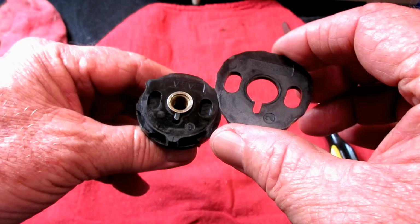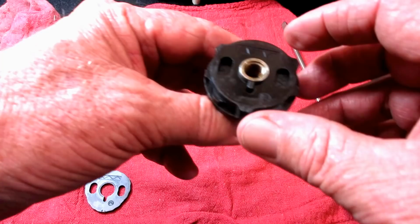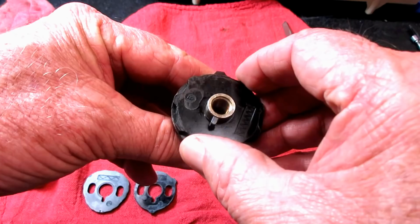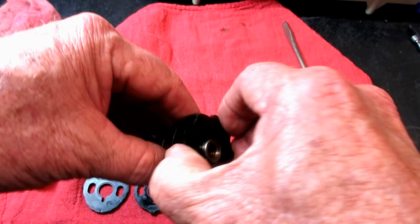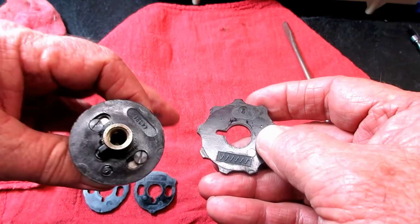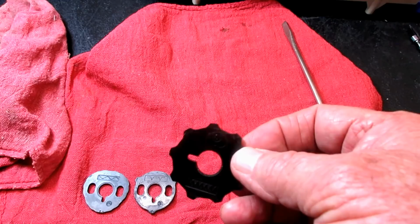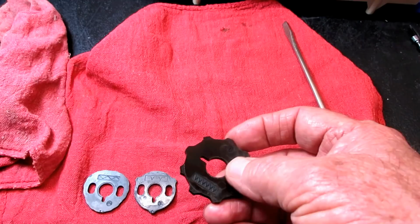You see they've got a little keyhole, and that fits on a part of the camshaft like that. So there's the number 2 on the top. Here's the number 5 blind hem in the middle, and here's the number 6 zigzag on the bottom. There we go, starting to come off there. So you see it has a pattern and a number in a circle. And every cam, either these flat cams or the top hat or the other style of top hat, the white ones that came in the 700 and 800 Touch and Sew Golden things, they all had this pattern and a number.